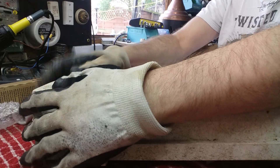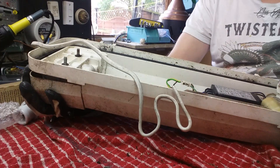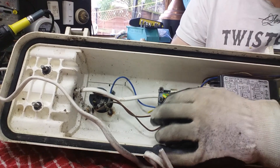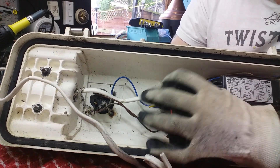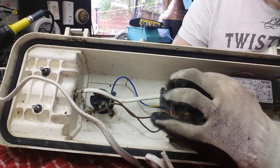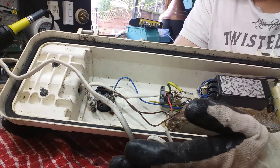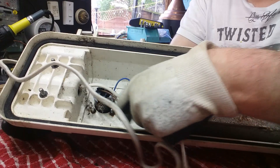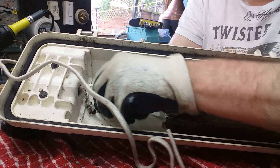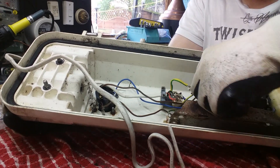Apart from that, that's about it really. There's all the usual little things in the back here — this little thing holds the cable. These plastic connectors tend to get crispy, so I take them out and replace them with a porcelain connector. I know sodium lamps don't give off much heat, but it's always best practice. The wiring isn't too bad, but while you've got it apart you might as well put new cabling in — just makes it more reliable and gives peace of mind.